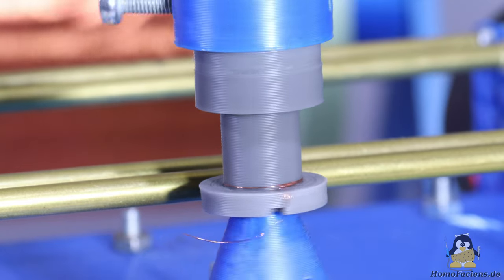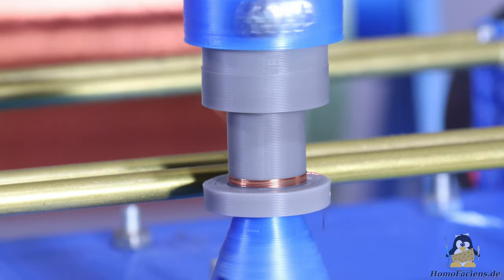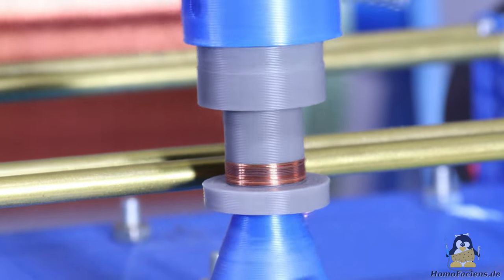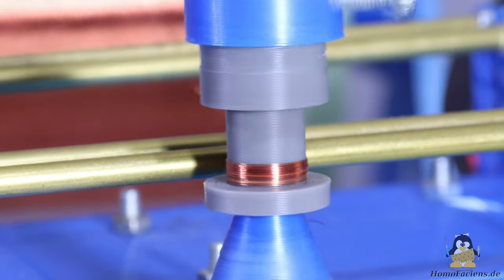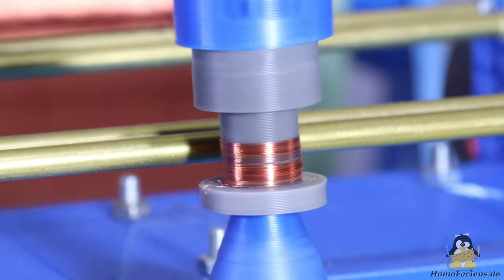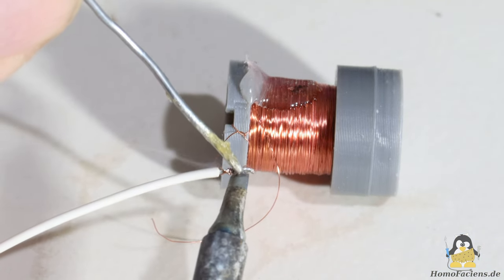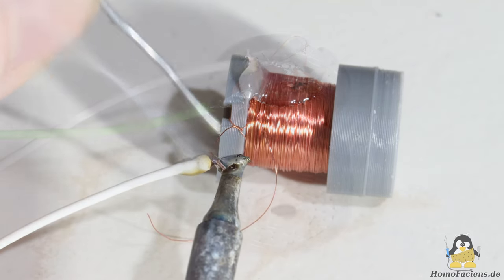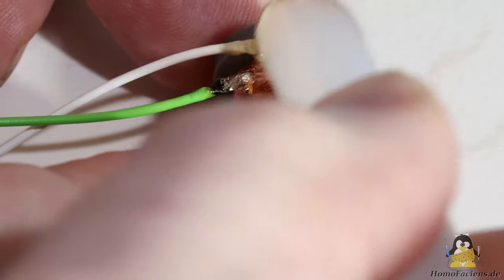For the total of 25 electromagnets, I made the corresponding core elements with the help of a 3D printer. In order to automate the winding process of the copper wire, I converted this 3D printer — there is a video and build instruction available on my website. 600 windings with a wire diameter of 0.1mm are wound on each electromagnet. I soldered stronger wires to the thin wires of the coils.